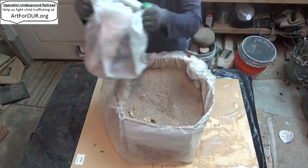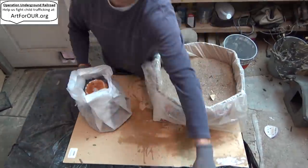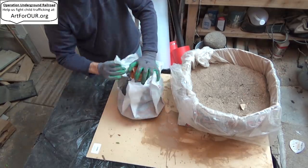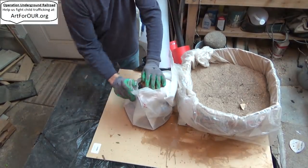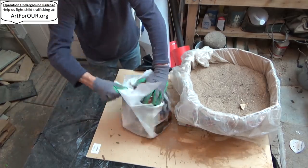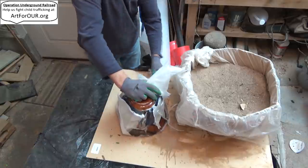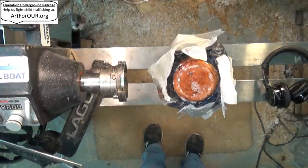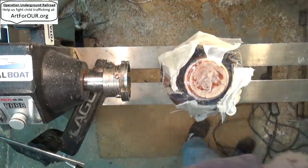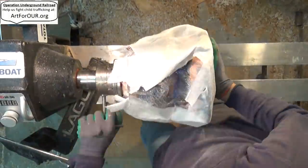What I'm working on is the folds. You'll notice the odder the shape, the more folds in the sheeting you have, and so you lose some resin in there. Probably would be a good idea to hot glue those or something, but I'm getting better and better at limiting the loss of resin, and that's awesome. So slowly perfecting my techniques here.